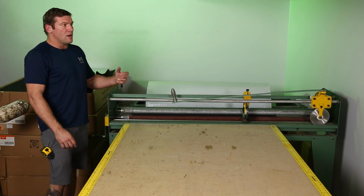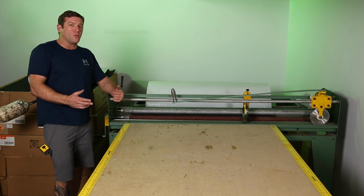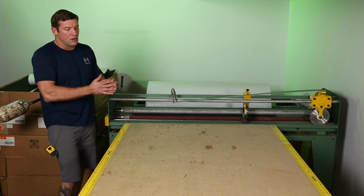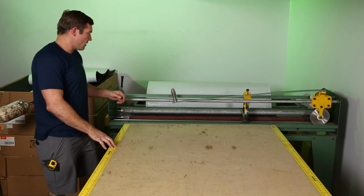Anyways, we're doing 12-inch pipe. That's what I'm going to line today. 12-inch pipe requires 38 inches of total width. And if we cut our insulation for the length of the pipe to be 58.5, that leaves us with 1.5 inches female side on that pipe. That allows us the clearance for the male side of the pipe to slide into that other duct. Let's go ahead and get started on this.